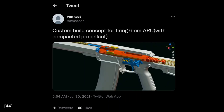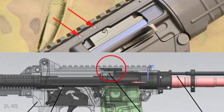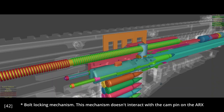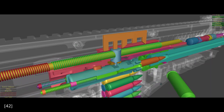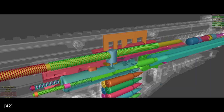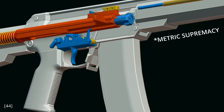The fire control group shown in the animation is correct though, which I will talk about later. Additionally, I am fairly certain that the cam pin locking mechanism is implemented in the actual rifles, because in this photo you can see the pin for the locking lever on the bolt carrier's tombstone, as well as two other pins which hold a piece of metal in place as shown in a CAD diagram of the prototype rifle. Interestingly, the Beretta ARX-160 also has a cam pin locking mechanism, but it's only similar in concept and not in execution. The inclusion of this mechanism in the ARX-160 is somewhat of a necessity because it has a polymer receiver and ejection ports on both sides, so there's not enough support for the cam pin. On the other hand, the Chinese totally could have left the AR-15 cam pin design alone, but they went the extra kilometer to improve it, which is pretty cool.